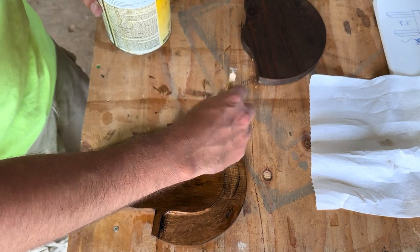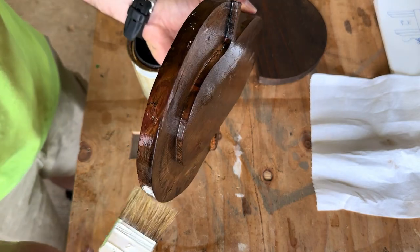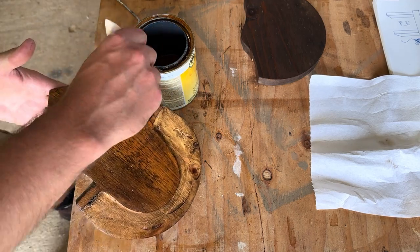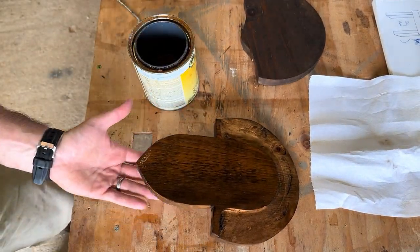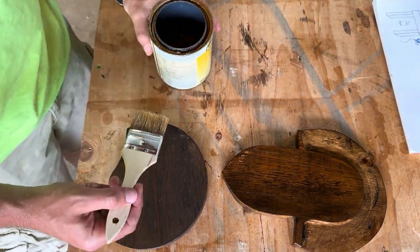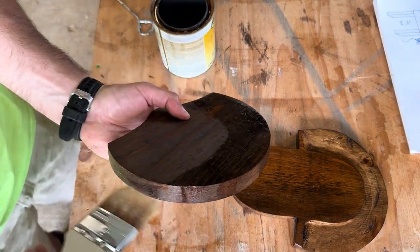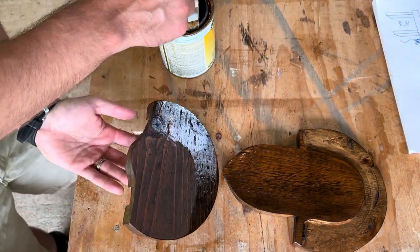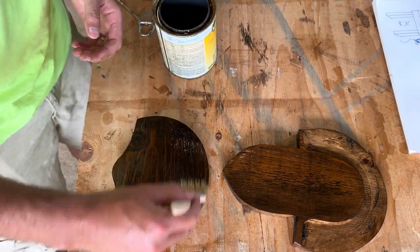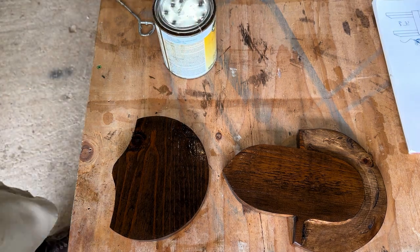All that character from the wood just pops, and it's great. The rest of it gets sealed as well, just to help from expanding and contracting and bringing in or releasing moisture. The whole thing gets a nice coating — probably about four coats, sanding in between each coat to flatten it out. Nice light coats is what we're looking for. This part does look darker than the other portion; it's from the same piece of wood but a little further down, which I thought was odd, but it still turned out good.